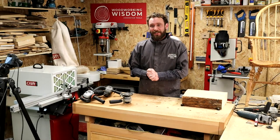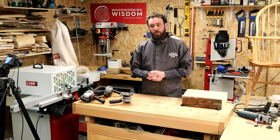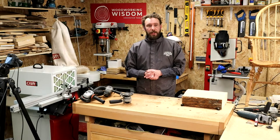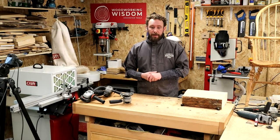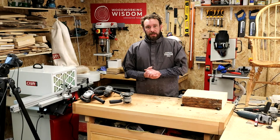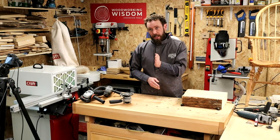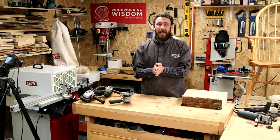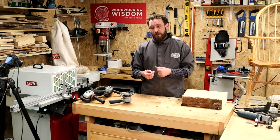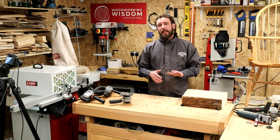All right, so another question. So I've got Nigel here. He's asked, he's got an angle grinder with a diamond edge blade. Would that be usable as a wood carving tool? Probably not. The diamond cutters are usually for stone, for tiles and things like that. Probably not. I think they're really good at a straight cut or a plunging cut. When you want to start putting sideways pressure on a disc like that, they would crumble. And especially those kind of metal cutting discs that you find, like the small ones you get with Dremels and stuff, I wouldn't bring them near a piece of wood.